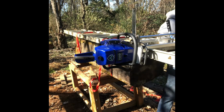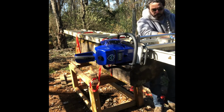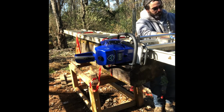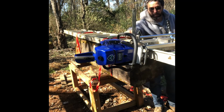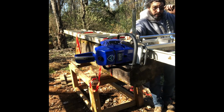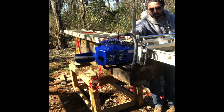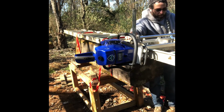These are just U-bolts in here, if you've never used one of these. You're going to want to make sure these are tightened evenly and not over-tighten them to where you crush this tube right here. If you crush that, you won't be able to adjust just those little bits. If I crushed that right now and I decided I wanted a 5/4 board later on, it would always want to keep going back to that indent. So you want to be very careful with that.